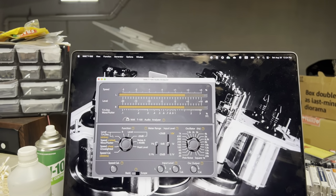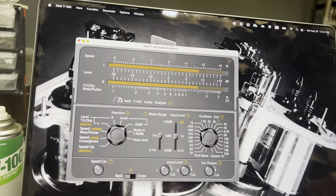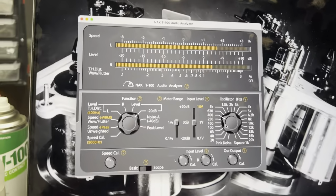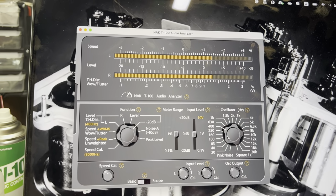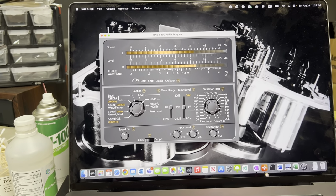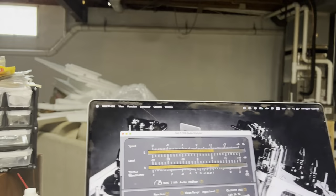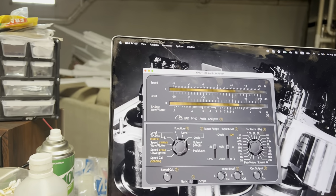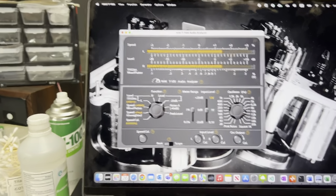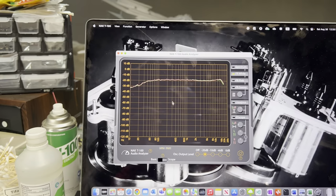But it's now like plus 3.5 decibels, and it was plus 2. That's why it's drifted. See, we need to make plus 2 on each channel. Now, when we get to 10 kilohertz, we need to keep the same plus 2 bias levels. Even. And now we should have a perfectly nice plus 2 decibel chart.